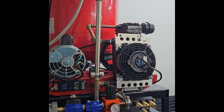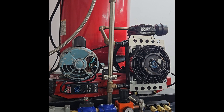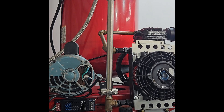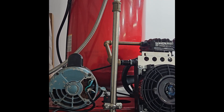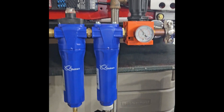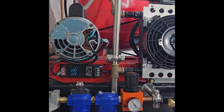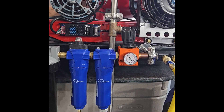After the air is cooled it goes into this stainless pipe, which is eventually going to get a Quincy brand QWS bulk moisture separator between the cooler and the tank. Right now it's back ordered, so I put in a little moisture trap down below and it seems to work really well. When the air is cooled, the water condenses in this piping and settles down in that valve and I can drain it manually.